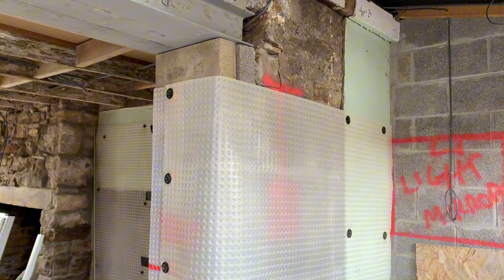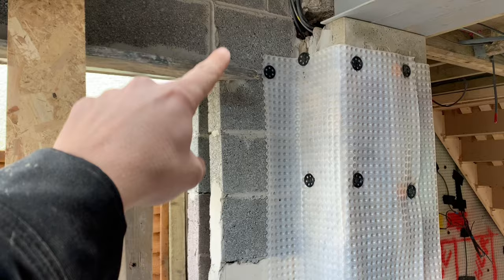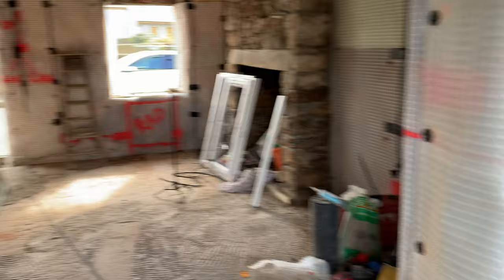This is one of them jobs where it doesn't seem to be ending. I'm just finishing off little bits. I've just put in this damp proof membrane because it comes around here - this internal on the extension is good because that's got its membrane installed, but with these because they're solid I just had to carry it around and do that bit. I'm going to be drilling, finishing off this, and then that is it for this side of the house. We're on with fitting windows and I'm just prepping for Dave.